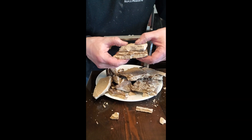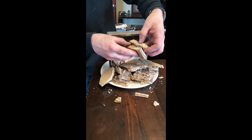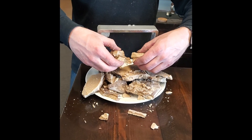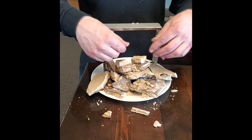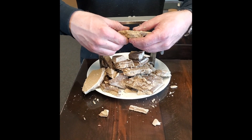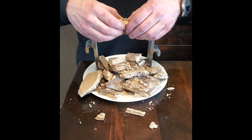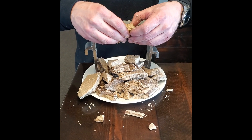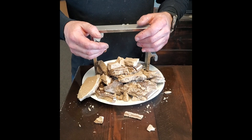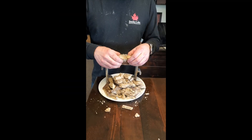Here is the thickness of the cake right there. You can see we just about maximized the capacity of this filter press. This is edible but it's not intended to be eaten. A lot of what's in here is the filter agent, but a lot of it is also impurities from the syrup — minerals and whatever tree matter might have gotten in from the tap hole — all filtered into this cake.